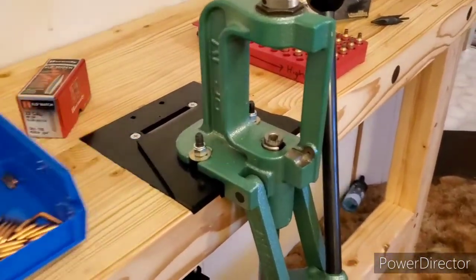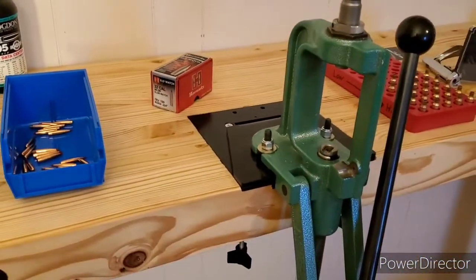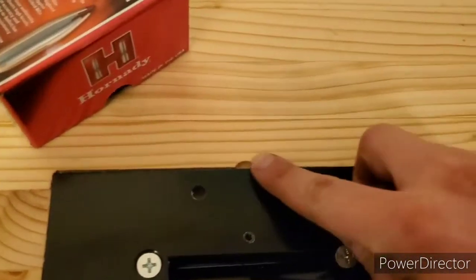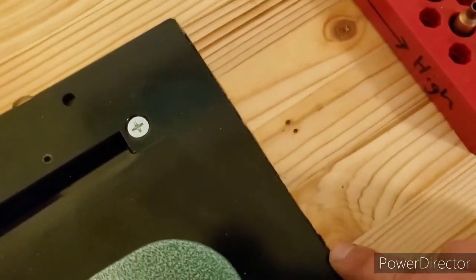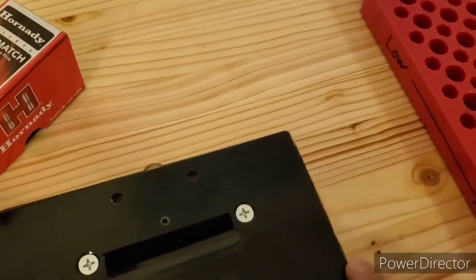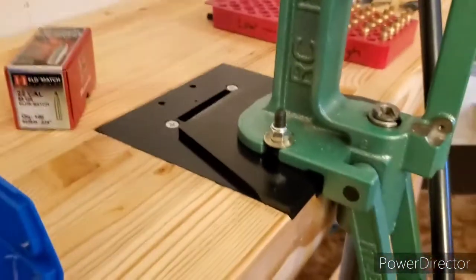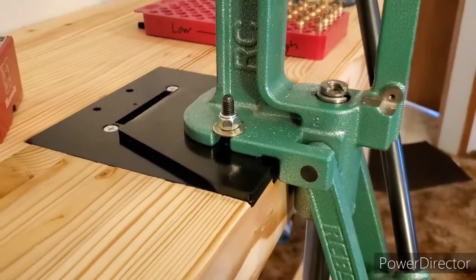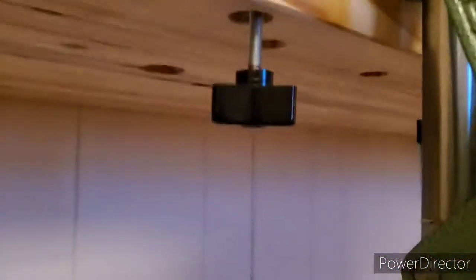The inline fabrication stuff — what I ended up doing with this, I wanted it to be a true flush mount. So I routed it in, did a terrible job. You can kind of see I messed up there and my edges aren't perfectly clean, but they're not terrible — they'll work. I might tape it off and fill it in with some wood filler. I wanted it to actually be flush, so I set it all the way in and drilled holes, countersunk everything.